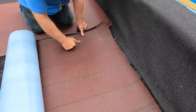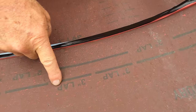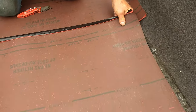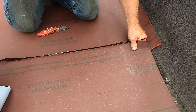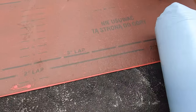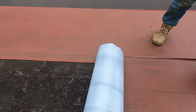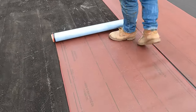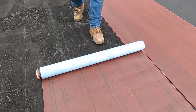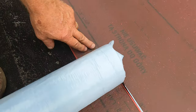They have markings of how you can overlap — three-inch overlap, that's what they require. So you follow the markings, and there are lines where I can roll my tool. I roll this out — this is the easiest way to do a roof. And I line it up with the line there.